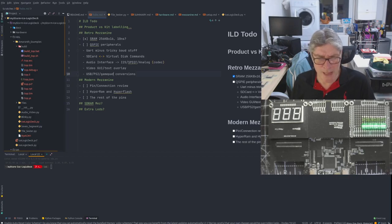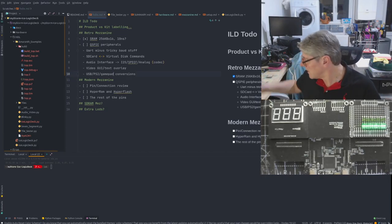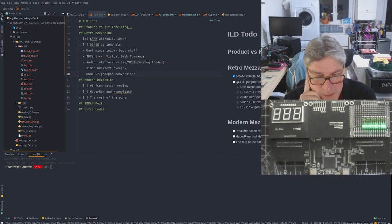So there are different ways of doing that. It might be best on that front to use the FPGA to do that rather than the STM32. I mean, you could offer two USB host ports. But you wouldn't be able to support the USB part of that on the FPGA very easily. I mean, I've not seen any small host implementations on the FPGA side.